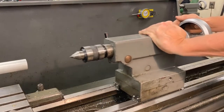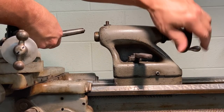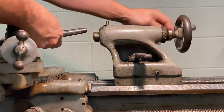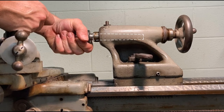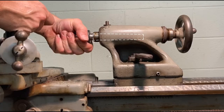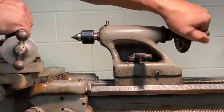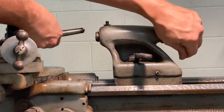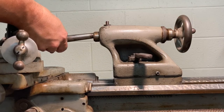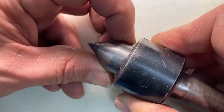We're going to use the tailstock to support the work. The tailstock rides back and forth on the ways of the lathe. It has a spindle inside it, and the spindle itself doesn't spin — it just holds parts. Inside it's called a Morse taper. These are available in different sizes; most of our lathes have a number three Morse taper, though this smaller one is a number two. The Morse taper is a very shallow, long, thin cone shape. The two parts will actually lock together — this tapered end is part called a live center, which is what we're going to support our work with.